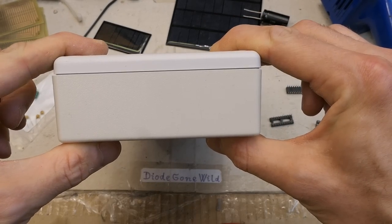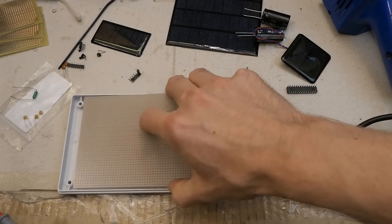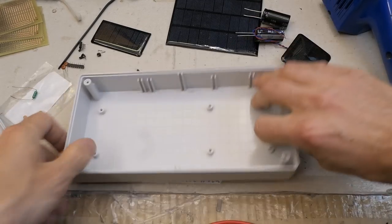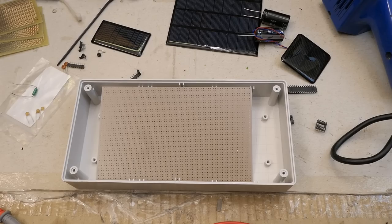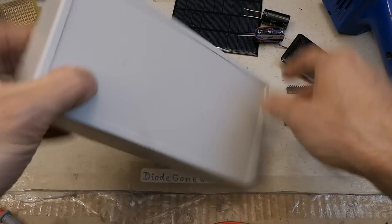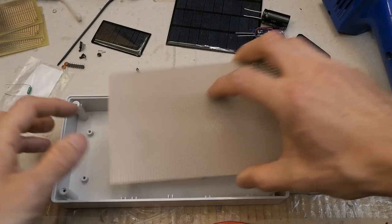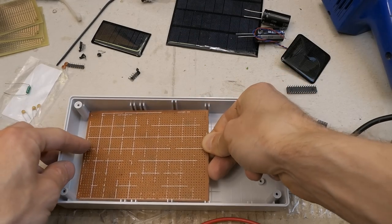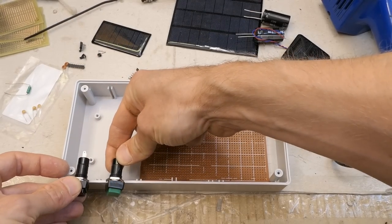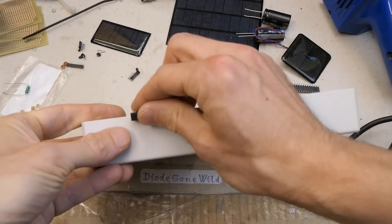The box is slightly slanted so it only makes sense for the narrower part to face up with the screws facing down. If the board is screwed onto this panel, wires have to go to the buttons and solar panels on the other side. Whereas if I install the panels on this side and put everything together here, nothing is hanging on wires that would break. The most likely solution is a board screwed onto four posts with space left for the big buttons.